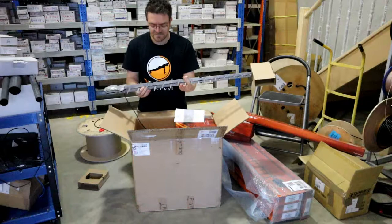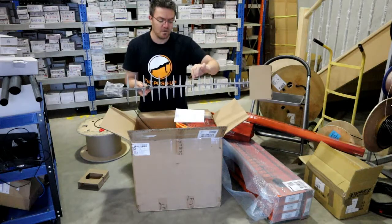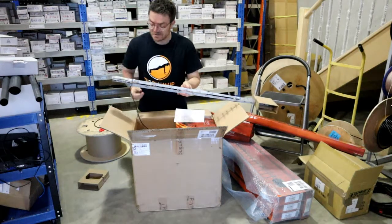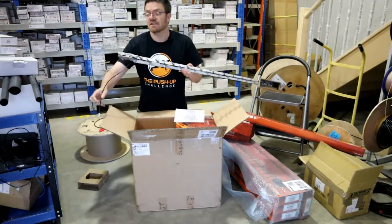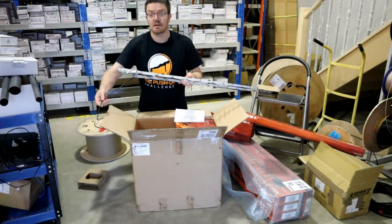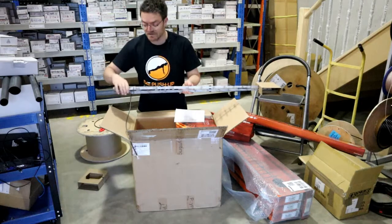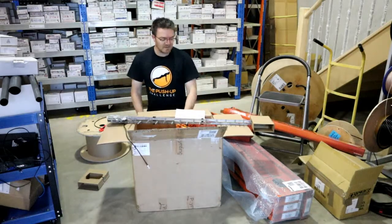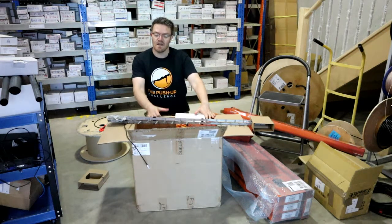It's cast aluminium, so there are no joints — these elements are all part of the whole structure, so it's really solid. That's one of many reasons why I love this antenna. It comes with a short pigtail cable, which gives you full flexibility through our shop to buy other cables of whatever length. Of course, when the length is longer than 10 meters or so, we definitely want to go for a lower loss cable to make sure it all works well. Unboxing a Pointing antenna — literally unboxing from the shipping box through to the inner box — and just showing the antenna we have in stock. It's on our website. Have a look and give us a call if you have any questions.